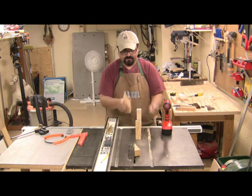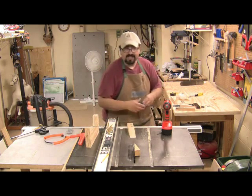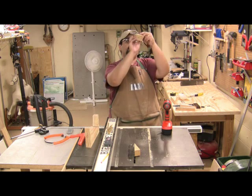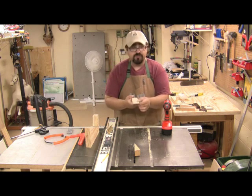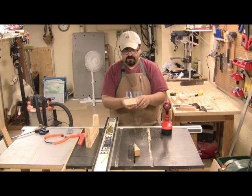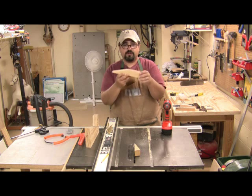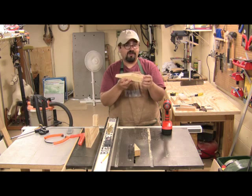The key is to make sure that the stock runs very flush with the surface so that when the cut is made you're getting a 90-degree cut all the way up. Let's go ahead and check this. Oh yeah, that's nice. We're still going to have to do a little bit of work with a hand plane or — you can sand it — to get this nice and flat. It's a little off, but essentially our plane is pretty much ready to go. We'll cut it to length, then start attaching the equipment to hold the blade in place. We're about 50% done.